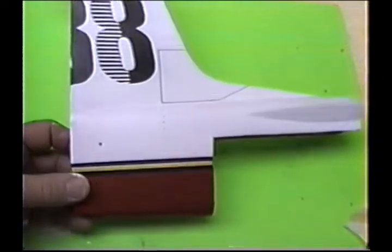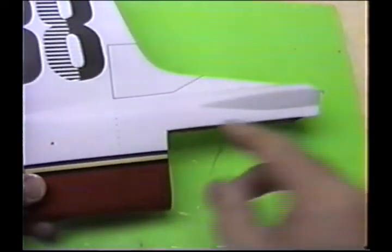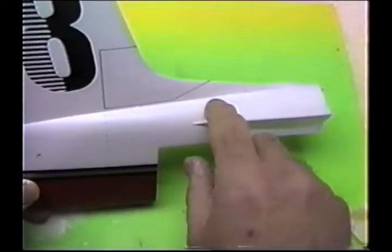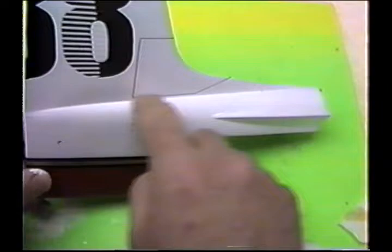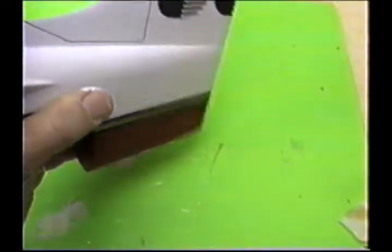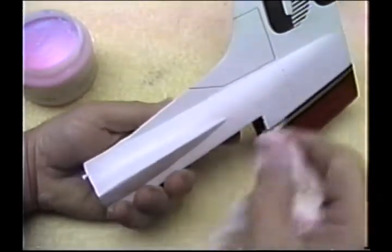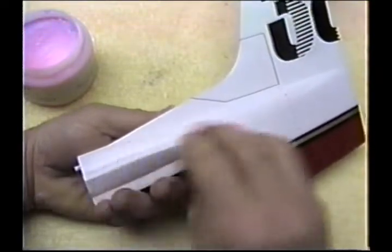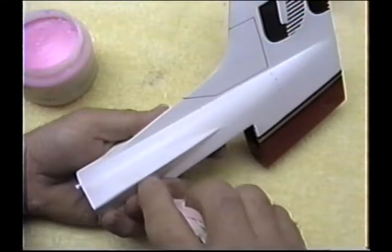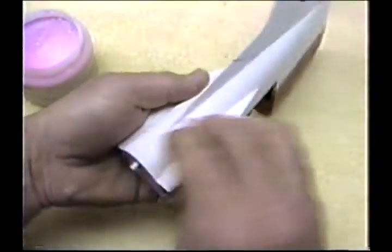Once we start on this part, we'll go through basically the same routine, but we're going to be real careful on edges — anywhere there's an edge. In the fillet, I'm going to get that little rubber tool to wrap around, maybe a piece of sock to get in there. I want to be real careful on all the edges. You've got to avoid the edge because if you start buffing it, in a matter of ten swipes you'll be through — you've concentrated all your energy on the equivalent of a razor point.